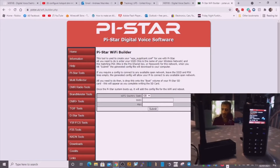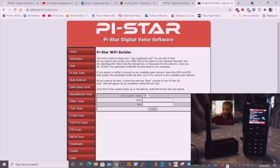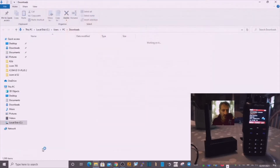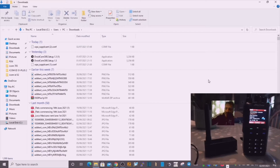Presuming that your JumboSpot has already been preloaded with the image that runs Pi-Star, you're going to take out the SD card from the side and put it into your computer so you can add your broadband details. So your username and password — let's say user and password — you're trying to link it to your broadband at home. Click submit, you'll get this file, then right-click and either copy or send it to the adapter plugged into the laptop, which will come up like a drive, and just send it into that.